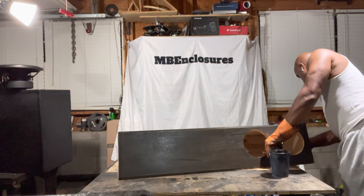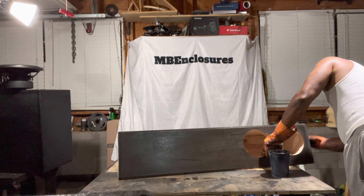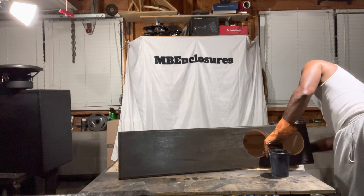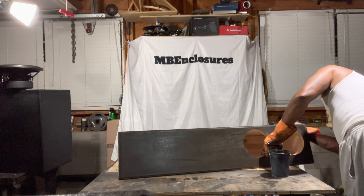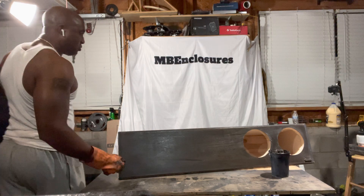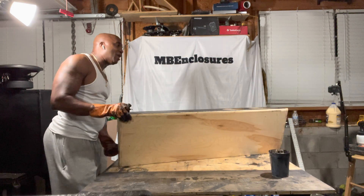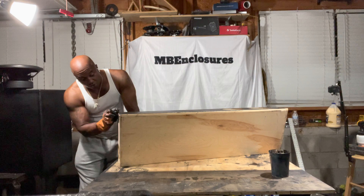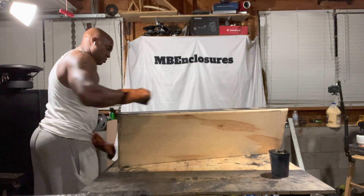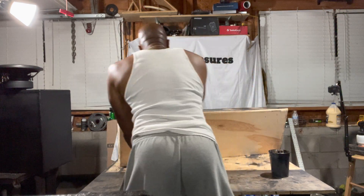I like the output of the X-Max. I know how to build enclosures so you don't have to worry about throwing gobs of power trying to get all your output from the X-Mechanical. I'm telling you to get your output from the X-Max — that's your cleanest, hardest-hitting bass. It's accurate, tight, controlled — what most of us SQ guys love. But there's a crowd that loves the X-Mechanical — that's the SPL crowd. They take the X-Mechanical into play because they're chasing numbers and need everything they can to get the desired result.